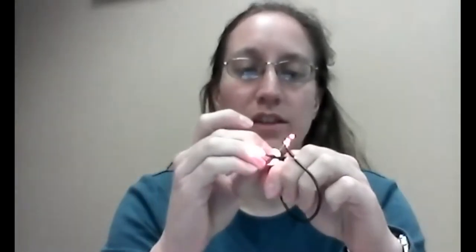This just helps hold your wires together. Once you have them wrapped, take your battery, put your free ends of your LEDs on your battery, and touch the wire to the other side. Both of your lights should come on. If only one comes on, you may have the ends of your lights switched and you'll need to take it out and switch it around. You may have to test them individually to figure out which one belongs where. But once you have both lights working, you'll move on to your red wire.